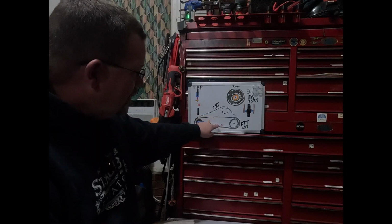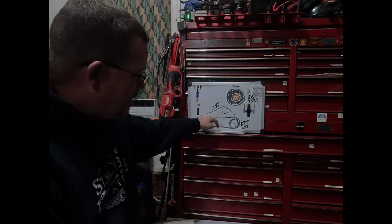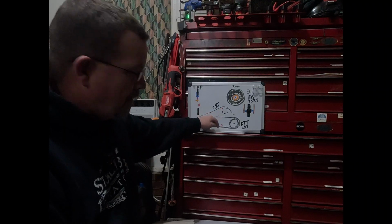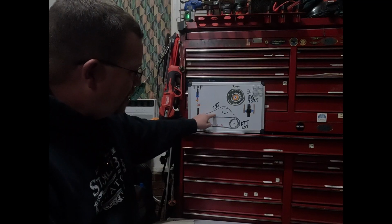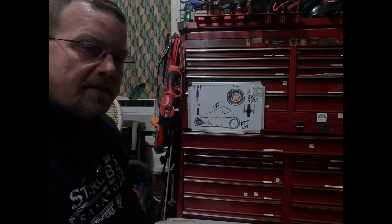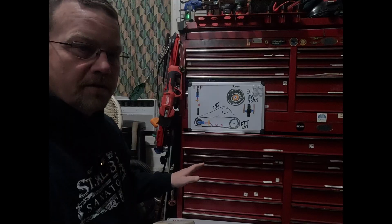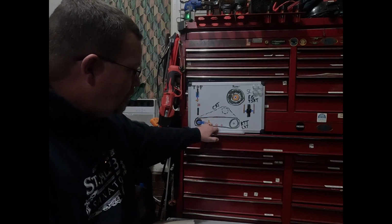Now you're going to say, well, Travis, you can't do that with the rollers, the bogies down here. That's okay. You can go opposite. You can push away from it. If you've got the room, go this way. Now in the CRT, you can go right about in the midsection and do a little bit of deflection there. Everybody does it a little bit differently. Everybody has their own little special thing they like to do. I like to go with 1 inch down and 1 inch down.